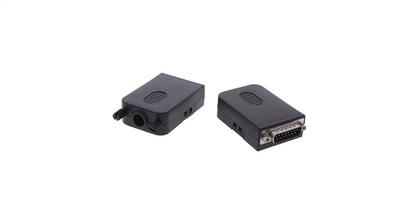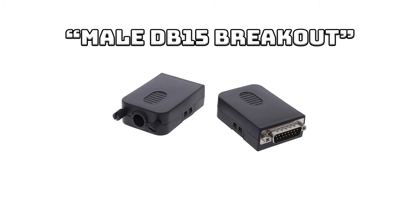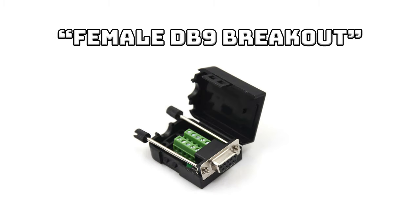In this series I'm using these breakout adapters — I bought them from eBay. The search terms you'll specifically need for this episode's adapters are male DB15 breakout for the joystick end, and female DB9 breakout for the console end. I'm well aware that this connector is actually known as a DE9, but if you search on eBay you'll probably find about 5 results for that, whereas there'll be thousands for DB9 — I guess that's just the way it goes.